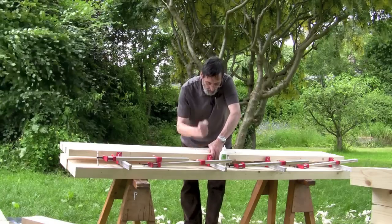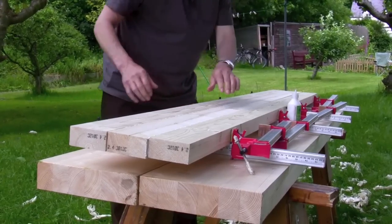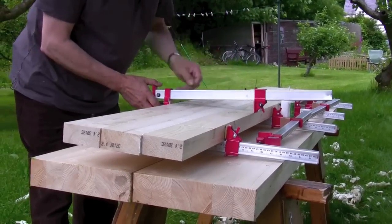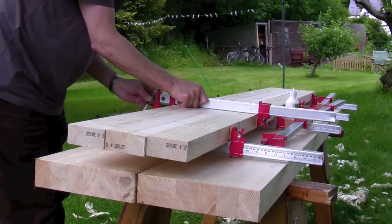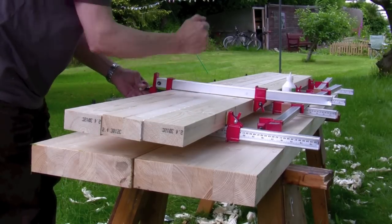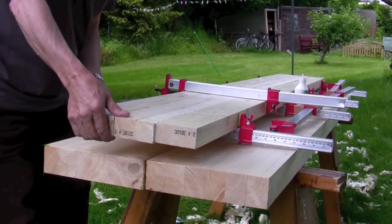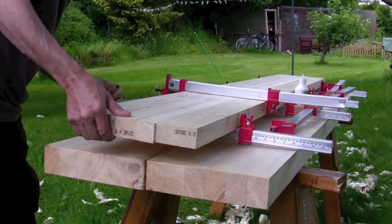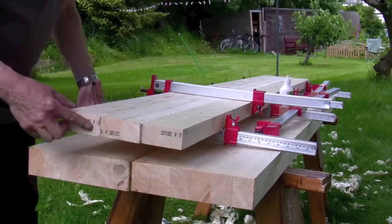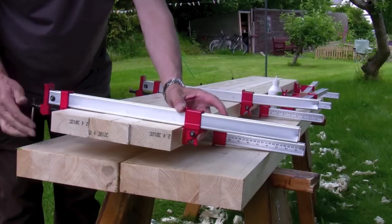Starting in the middle — keep them as flush as you can. This one's a little bit low so I'm going to go with one of my top clamps here. There's just a hair difference between that one and this one, so I cinch up and then pull up on this one — they're flush. Then this one is high on this side and low on that side, so I'll be conscious of that. Nice and flush there — watch your length, I've got a little stagger but these are not even lengths either.